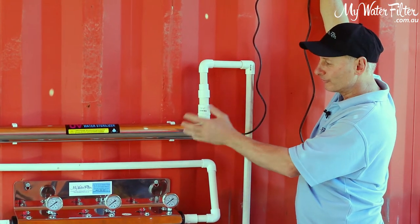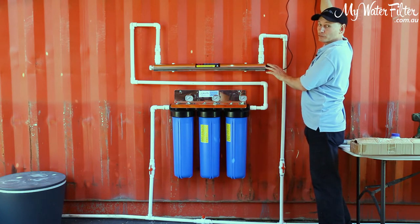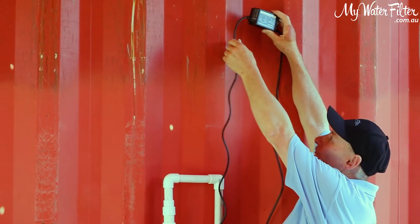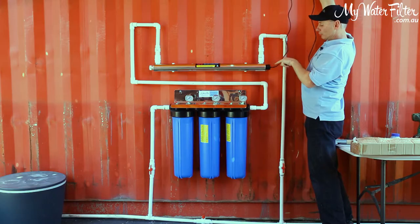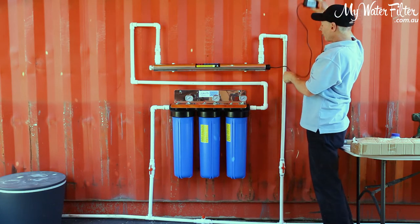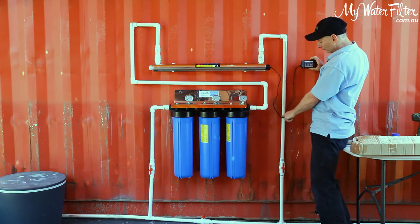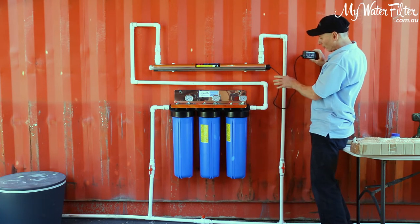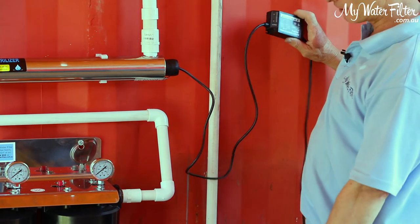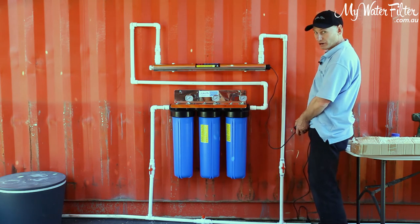This is a UV system, so it does have water inside. It doesn't mean that they want to have water in here, okay? We don't want to have any water in the electrical components of the system. Now, if you have this box up the top, when we get the condensation in Australia in winter, that condensation runs down the cord and it will run into the end of the globe and the electrical wires. It's going to short out and it's going to ruin it, all right? So you can have the box up, but this lead has got to dip down first, okay? By dipping down in a V shape like so, any condensation on this cord is going to run down and just dribble off the bottom. And then this cord can go wherever you want, run it up to the plug above your head, whatever. But when it comes out of the UV, the cord has got to go down so that all the water's running away from it, all right?